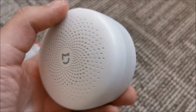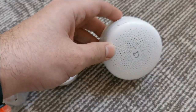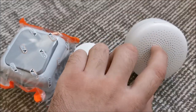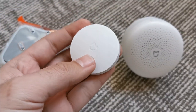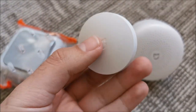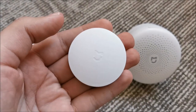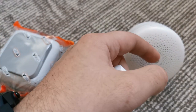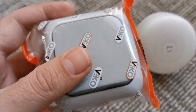This thing has been opened up; somebody poked around with it. The guy that sold it told me he tried to modify it, make his own 3D-printed case — weird things. He basically does things like I do: change, modify, repair everything. Anyway, this is still working for what I need — a doorbell. Perfect. This little guy is really cheap, but it's not rated for outdoor use. Water will get in and destroy it. Also, I'm not quite sure how the little battery inside will respond to really cold weather — it might get too weak to send the Zigbee signal to ring the doorbell.